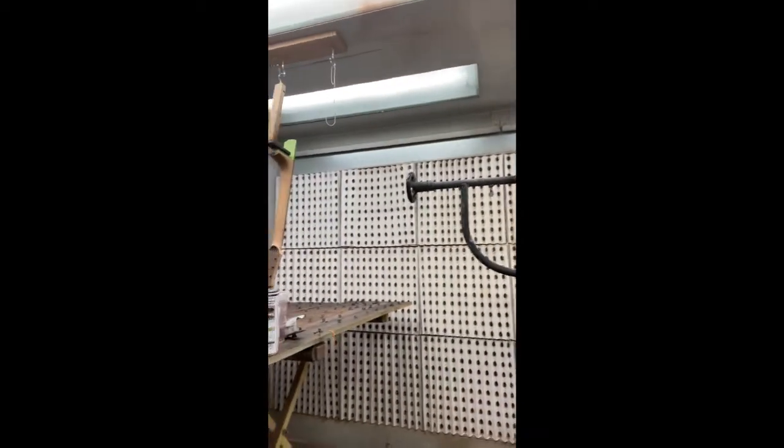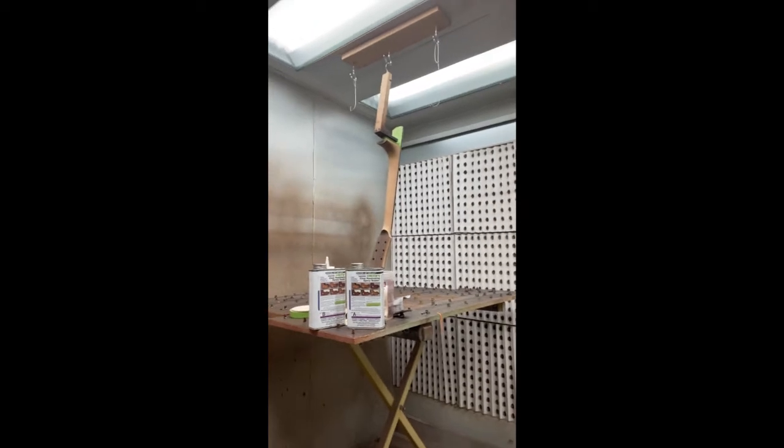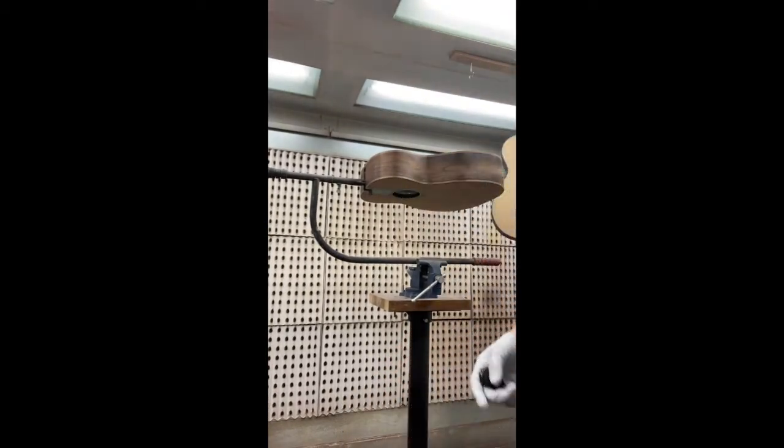And the stuff that I get is made by Smith's. It's this stuff right here. It's sold as a two-part liquid formula, part A and part B. I have the cold weather formula that I'm using now because it's kind of cold now, but they have different weather formulas that you can use. It's very simple to use. It's just a 1-to-1 mix. I mix it in a mixing cup like this, and then I just apply it with a paper towel that's wadded up. So let me show you how I apply it.